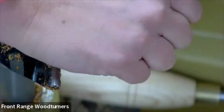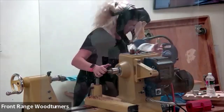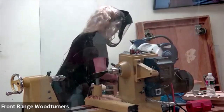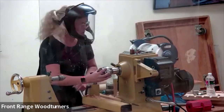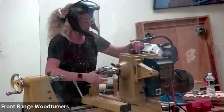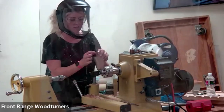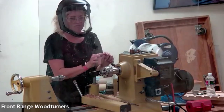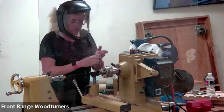And then the nose is the same process that we did, just on a smaller little scale here. And there we go. That didn't need that. No tenon on that one. Because of the size, you'd have to make a really small tenon, and then to drill that into here, you risk coming up through the side of the hat. So this, I just glue the entire thing on without a tenon.